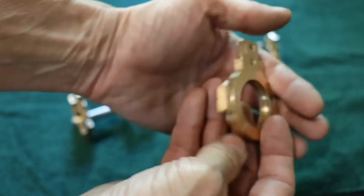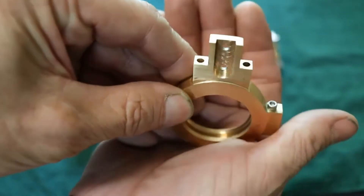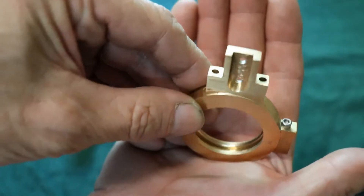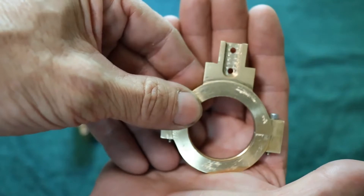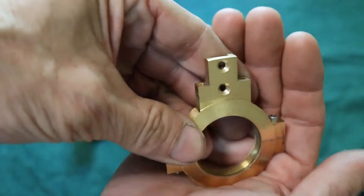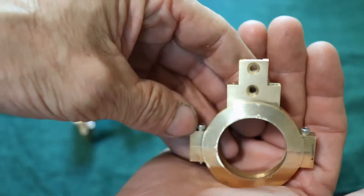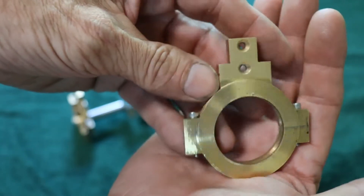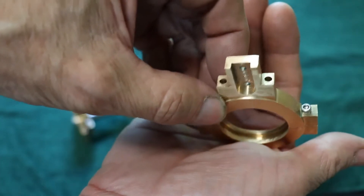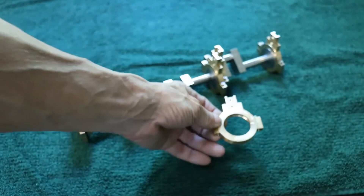This isn't working too well — problem with raw video. You'll also notice that I don't have these finished as far as surface finish. I'm not going to polish them until the very last step — that's way in the future, once the engine is pretty much completed. There you can see my countersunk holes for the flathead screws that are going to be driven into the eccentric blades, which go up and connect to the expansion link.